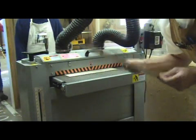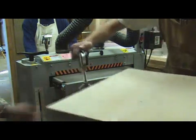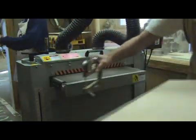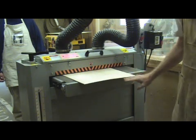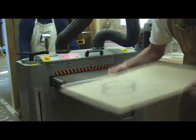The tops are really beginning to loosen up now as I get closer to my final thickness. Watch as I flop each top and listen to it. Occasionally I also check it with the calipers. A judgment call needs to be made of whether or not to send it through the sander again or stop and work with this final thickness.